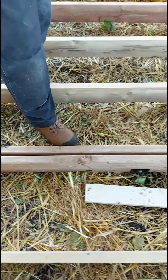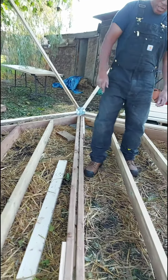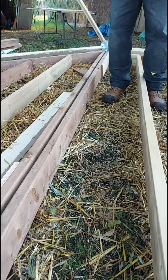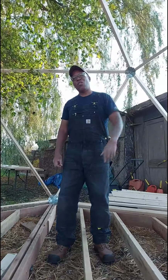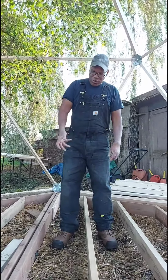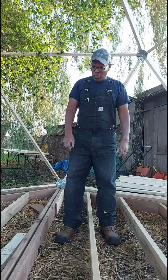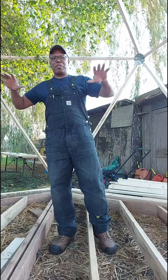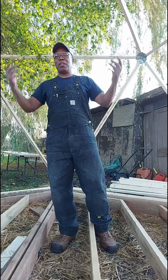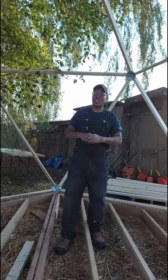and this, what you see over here, the leg bolt, is actually a screw pile. And the two other ones are over there. But we have screwed down 4 feet. And then we've attached the beam to this. And that's what keeps the structure from uplifting and flying away to Oz and all its magic.